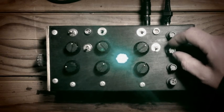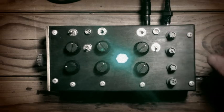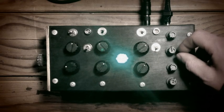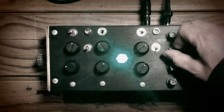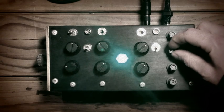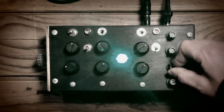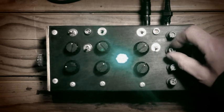And this is some kind of mix between the unfiltered signal here and fully filtered, fully clockwise. In the middle, because it's a phase inverted mix, you have both signals canceling each other out. So it's kind of a shaping of the tone knob with a non-linear function. Also, when it's on fully dry and you still have the resonance on, it's not 100% clean, because it's a passive blend filter,